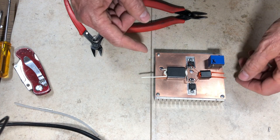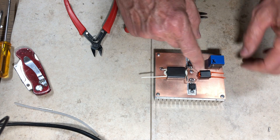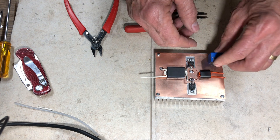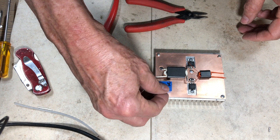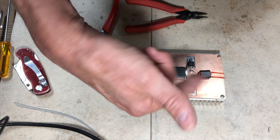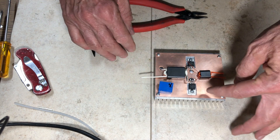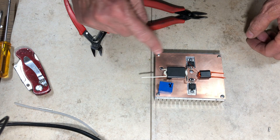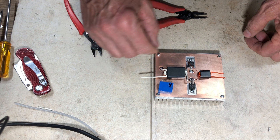I like to place parts ahead of time to make sure I have room for everything. Here's where the input transformer will sit, and there will be two relays — one approximately here and one over here — to allow the amp into the circuit or bypass it. I'll save room for the RF sensing circuitry to drive those relays and room for the bias circuits.